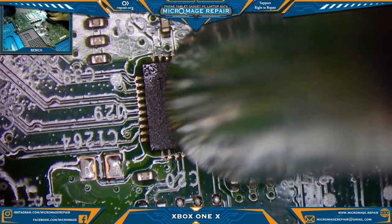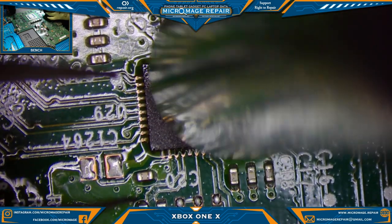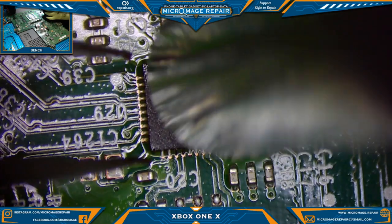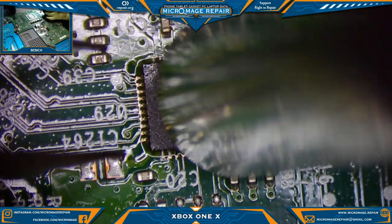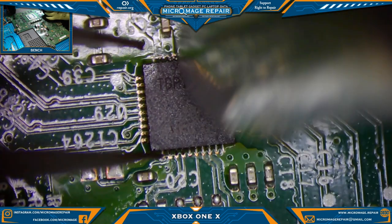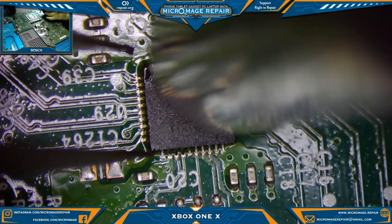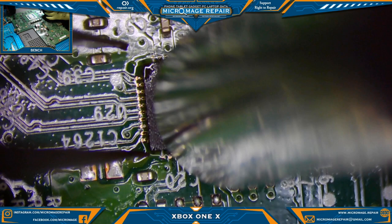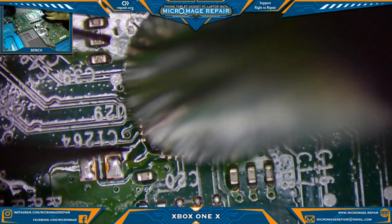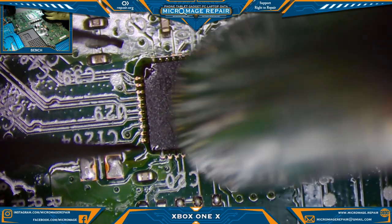You're just trying to see some wetting on the bottom. See how long this is taking — I have my hot air station on full blast, highest temperature setting, highest air setting. Patience is key. That center pad is going to take forever. This is unleaded solder, so it's a very high temperature solder. That being said, I'm not used to it taking this long — I'll have to check my settings.